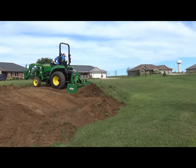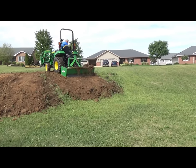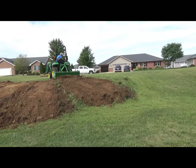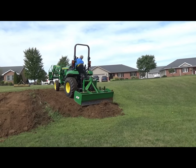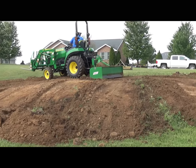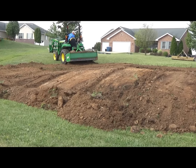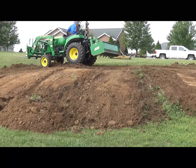This is pretty nice — demonstrating how effective that back blade is. I like the weight of that box blade. I can remove soil going forward, drop it off, and push it backwards off that edge and start rounding that down. Sometimes it doesn't dump out so I just tip it forward. You heard a funny noise as I rotated and changed the pitch of the box — I think that's where the studs go through the lower lift arms. There's no grease on that so it makes a chattering noise. Maybe a little WD-40 or fluid film on it, but it's not a deal killer.